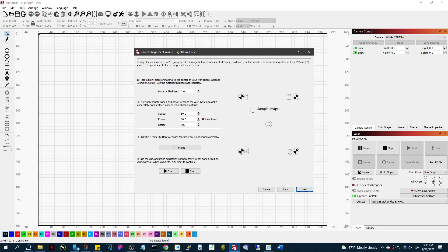You need to use autofocus in conjunction with the camera so that your perspective stays the same. You can sacrifice your accuracy and positioning if the camera is not in the exact same position from the surface of the material every single time — that's why it's good to use autofocus. If you look in the 'Basics of Focus' article there's more on that, and the second video talks about how autofocus works with the camera. If you have any trouble, email support at ThunderLaserUSA.com.